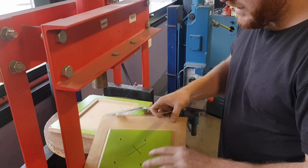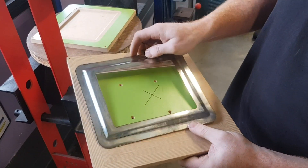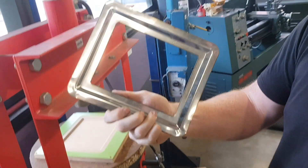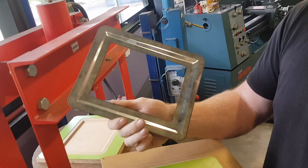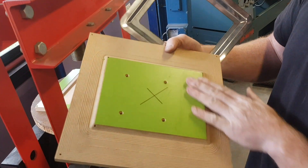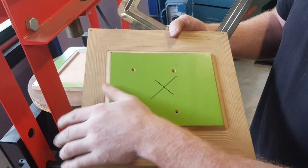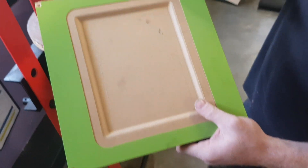As you can see, the stainless steel is now conforming to the shape of the plug and that's coming out pretty nicely. There was no lubricant or anything like that — a lot of people spray cooking spray or something on the surface to stop it from gripping the plug and tearing. But there's no noticeable damage, wear, rounding, or anything on the surface of the plug or the die, so I think that's a pretty successful test.